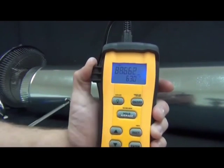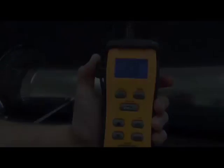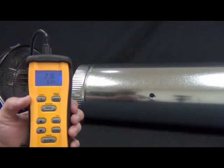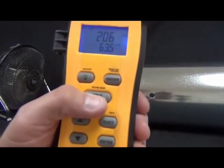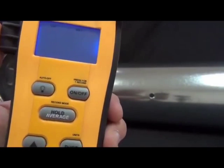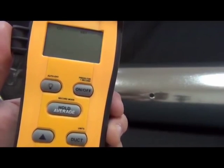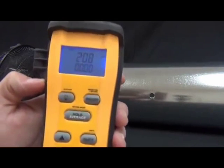To get into record mode, press and hold the hold/average button. You'll see a little stopwatch blinking — that is the signal for timed average mode. Press enter to select it. You'll then see the feet per minute as well as a timer showing how long you've been taking measurements. Use the up arrow to switch to temperature or CFM while it records. I'll leave it on CFM and stick the wand in the duct, making sure the flat side is pointing into the airflow.